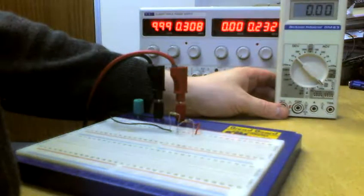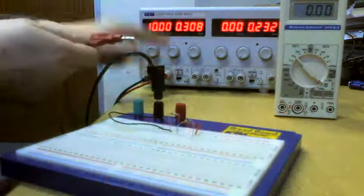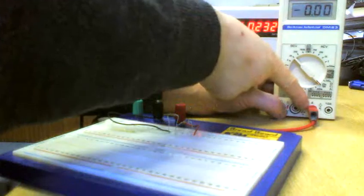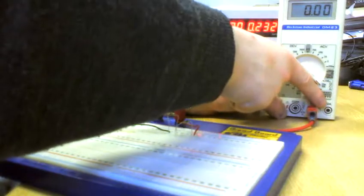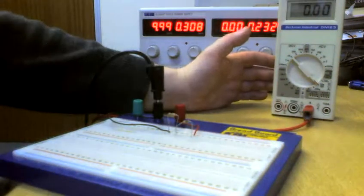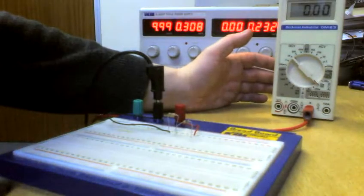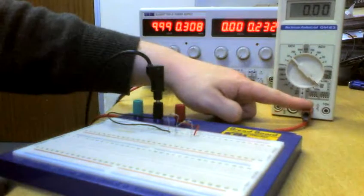What do we have to do? Break the circuit — our supply, which comes from plus. This goes into our amp socket. On this meter you've got two amp sockets: one for up to 250 milliamps, and if you want to measure amps you shift it over to the 10 amp socket. We want to measure in the milliamp range because we've got kilohm resistors — we're putting in some volts, so we expect milliamps or less. So we're plugged into the current socket.